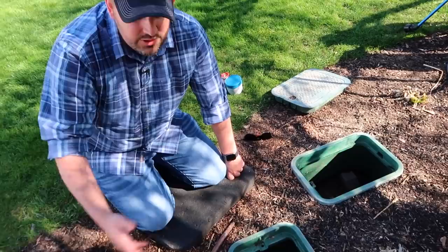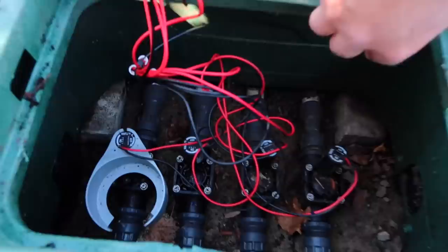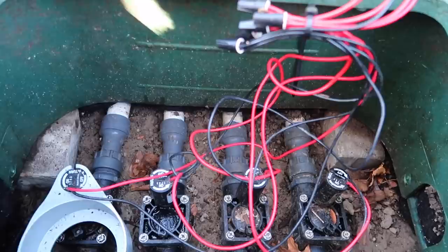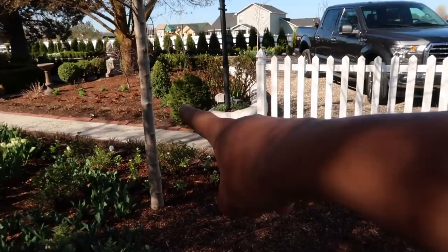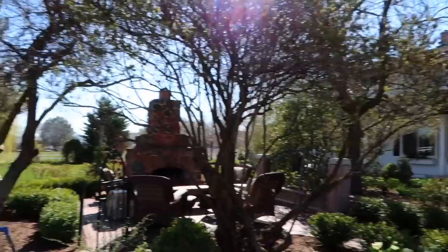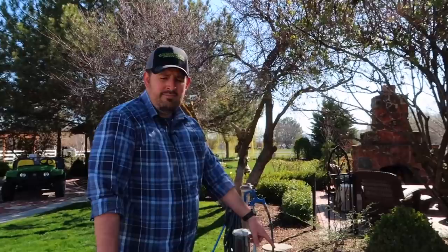You might be wondering where the lines go. If you look down in here, there are four lines going in different directions — one, two, three, four. They pop up right underneath the ground and convert to drip tubing. One of them goes across — we went underneath the sidewalk back when this area was torn up and fed that area. That's one zone. Then this is the next zone, tied into drip tubing here. The next zone has a black line that goes over and feeds underneath the trees. And the last zone is the kitchen bed. So there are four zones fed off of this one unit, and that's how we water it.